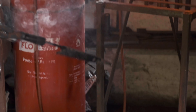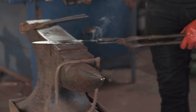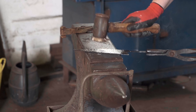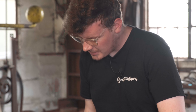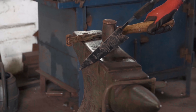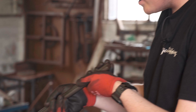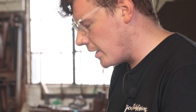Take it out and check if it's straight. This has got a slight warp in it, but while it's still in this tempering range, you can take a soft-sided hammer and just tap it a little bit across the anvil to bring it straight. A lot of people are very afraid to do this, but it's generally pretty safe until it gets too cold. That started to cool down now so I won't hit it anymore, but it's nice and straight. It's got a very slight warp in the centre — we'll take that out whilst we're tempering it.